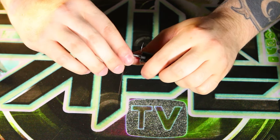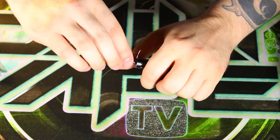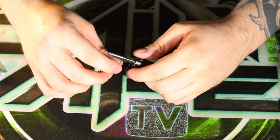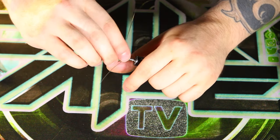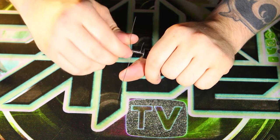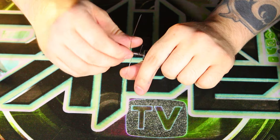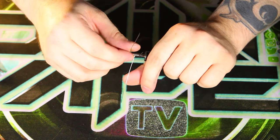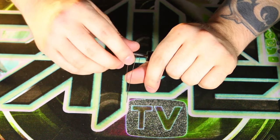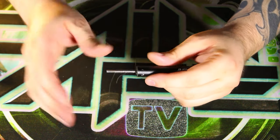The next step is getting these coils separated. I like to straighten out my leads as much as possible. I know this isn't the easiest way to do a spaced coil, but it really works for me, especially when you have it still on the jig. I just spin this lead and that causes the whole coil to separate from the other one. Once you get into that rhythm and motion it becomes really easy, making a perfect spaced coil every single time.